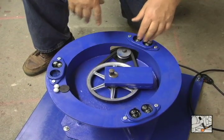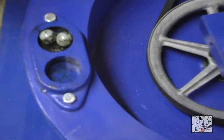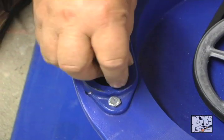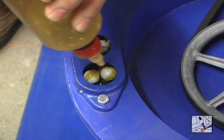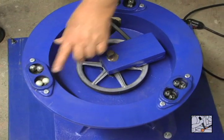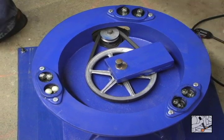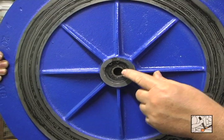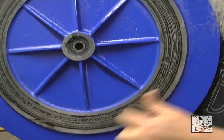The pan will rotate on these bearings. The bearing keeper is already attached to the machine. Into it goes a steel plate and two balls in each section and a bit of oil. With the balls all set up, oiled, ready to go, the top plate goes on. This is the bottom of the Reciprolap pan — the top plate. This is the bearing that sits on the off-center shaft on the base, and the balls run around on this race.